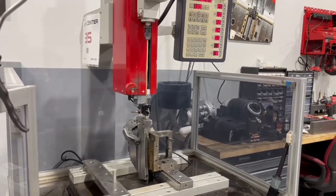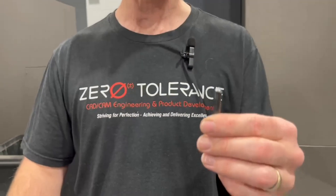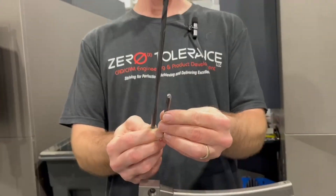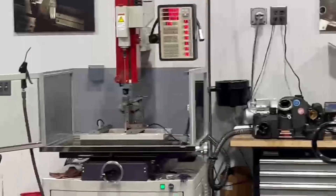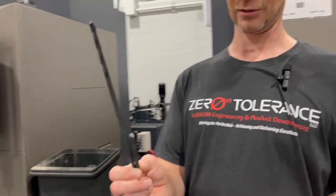We're going to let it try to get down in Z — it looks like it needs to go another 3 inches. I want to cover this drill that we broke off in this block. We've drilled many blocks like this, very long. Here's the length of the drill that we pulled out — that's actually broken off inside our block. The flutes aren't very long; we were only taking a 10-thousandth peck, trying to be very conservative. We've gotten away with it on a lot of these blocks, but this one is not so lucky. The one in that fast hole machine still is going to be a challenge — I have my doubts about getting it out, but I have to try. Fast hole EDM is really the only way I can see us getting it out of there.